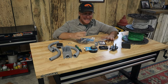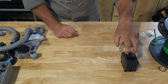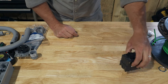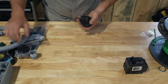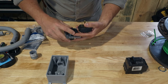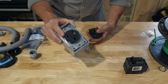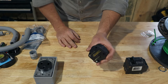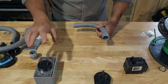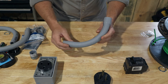This 220 setup should be about as easy as it gets. It's very simple and here's all the parts we're going to be using. We have a 40 amp breaker that has the specifications required for our welder if you stay within the 40% duty cycle. We're going to be installing this to run our welder, and our welder is going to be plugged into this three prong receiver that is going to be mounted into this receptacle box.